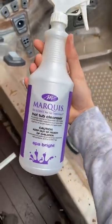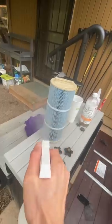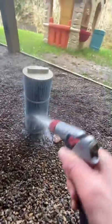From this experience, I learned how to clean hot tubs really well. All you pretty much got to do is drain the water and pick up a hot tub cleaner kind of like this one to clean off any mineral deposits that build up. Also, don't forget to clean the filter because that's super important. All you got to do is twist it off, take it out, and then spray with some chemical and just hose it down and it should be just fine.